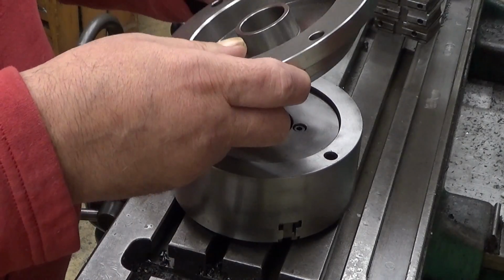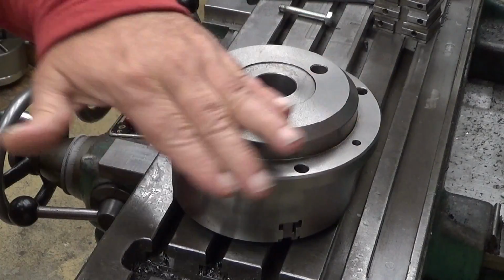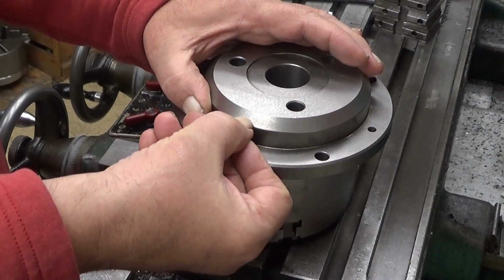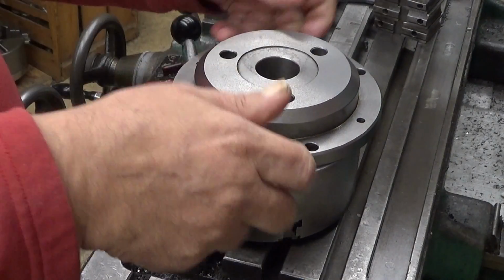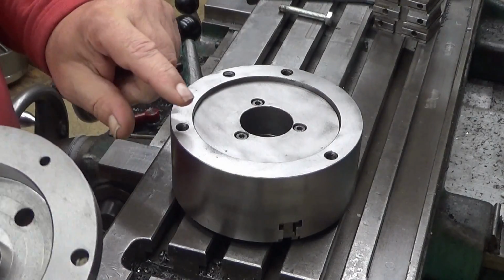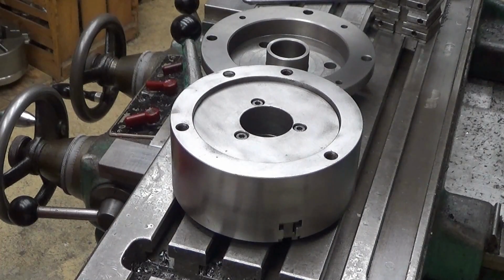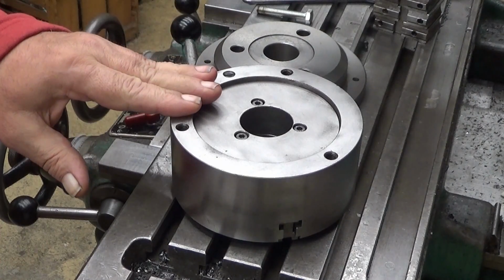Well, yeah, okay. So what we need to do is take something off from this surface. We have about 10 millimeters down there, so we can take it down about here, and then make this recess here so that it fits perfectly. And then we need to do something for those threads, which are M8. So, well, this will be done in the lathe. So let's go and just do this.